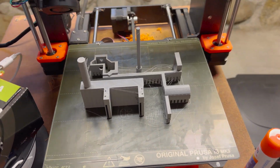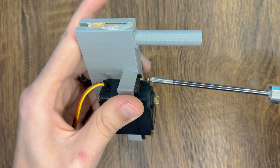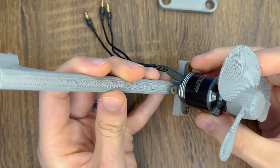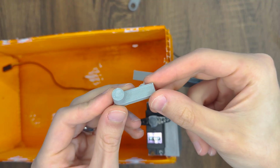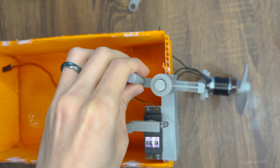Now, 3D print all of the files that are in the description of this video. We're gonna start by screwing in the servo into this piece and then sliding it onto the back of the boat. Then we're gonna attach the brushless motor to this long piece and slide it onto the parts that's holding the servo in place. Finally, we're gonna hot glue this piece to the servo and then this piece to the part that's holding the brushless motor.